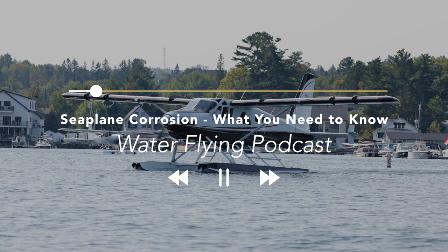What exactly is corrosion? On the simplest level, corrosion is just the exchange of electrons between two parts of the airplane, and that exchange creates corrosion. So it's an electrical process. That's exactly right. It's interesting because you wouldn't think of that — in an airplane you have your electrical system, but you don't think of the actual metal of the airplane being electrified, in quotation marks. Whether the airplane is sitting on the ramp or sitting in the water, there are electrical processes going on.